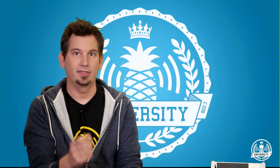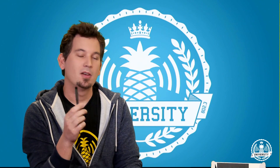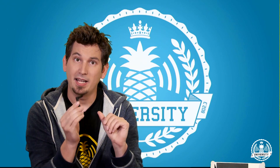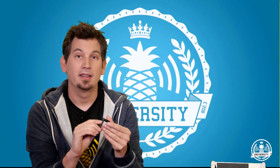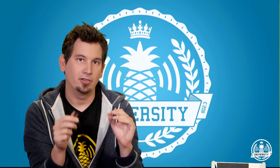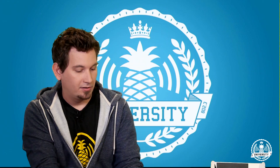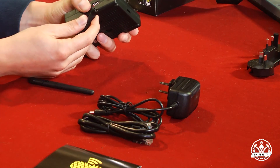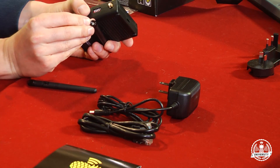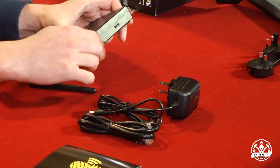Now about these antennas: these are SMA antennas — not RPSMA, which you may be used to. They are actually very high gain. They're rated at only 6 dBi, but they outperform the 9 dBi antennas on the Mark IV, the previous generation. There's no pigtail here; there's a solid connection right onto the board. Note that when you go to screw this on, the antenna has the pin inside it and not the connector. I'll go ahead and get that screwed on.